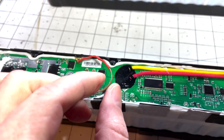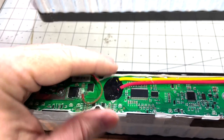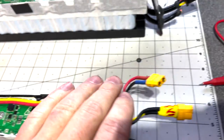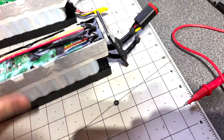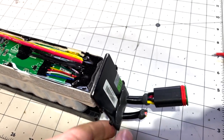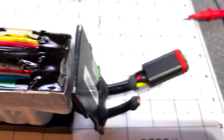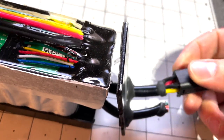The other thing I'd advise: before you do the hack, add a switch so you can turn it off — once you disconnect it, the BMS should shut off. Also, before you do the hack, disconnect your connector so there's no voltage. When you cut those wires, don't cut them all at once — that's a good way to short yourself. Cut one wire at a time and it should be fine.